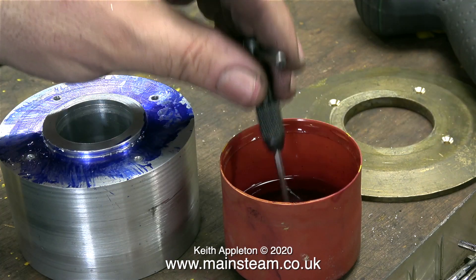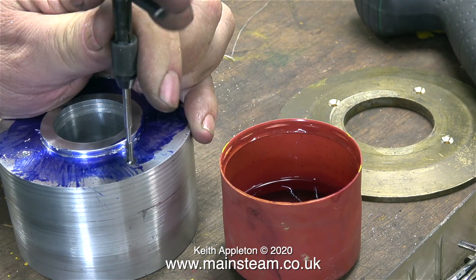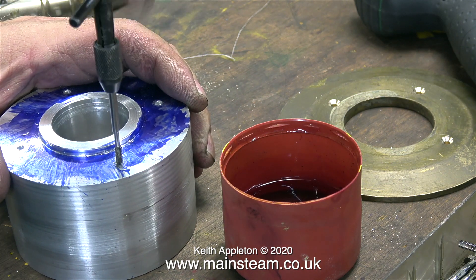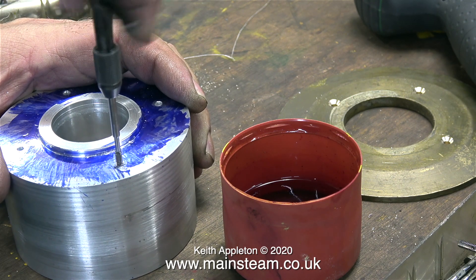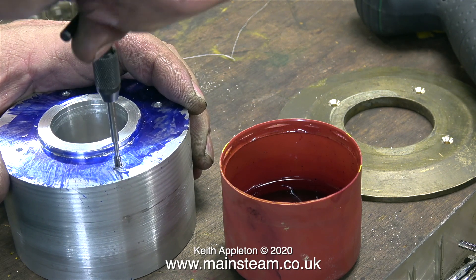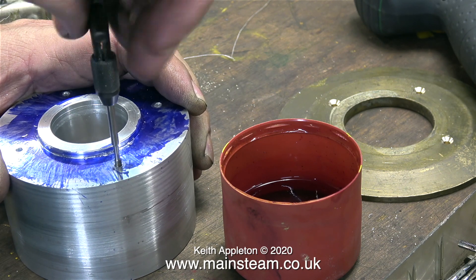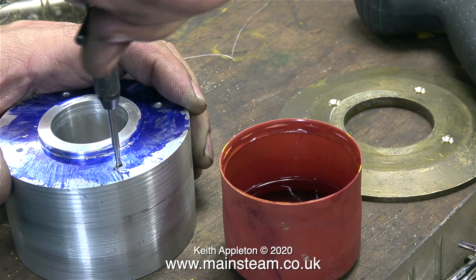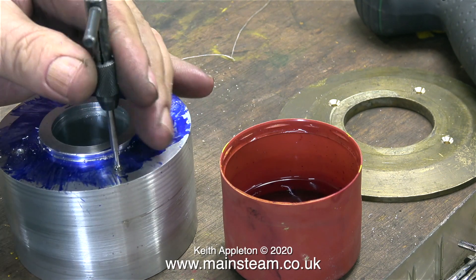Now I just need to go to the drilling machine and drill the holes 1/8 of an inch diameter in the aluminium part. Now it's tapping time. I've dipped the tap in an aerosol can lid containing some white spirit — white spirit, paraffin, or even WD-40 is quite a good cutting lubricant for aluminium. I drilled the holes in the aluminium quite deep for a couple of reasons: one is I need to fit long bolts without shortening them, and I happen to have quite a lot of countersunk 4BA bolts that are a bit long.